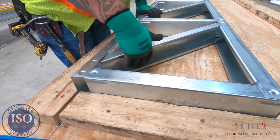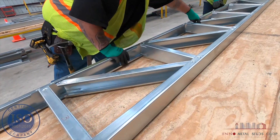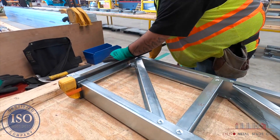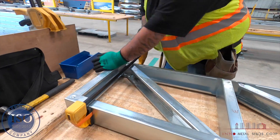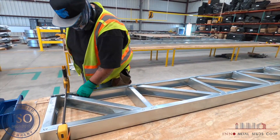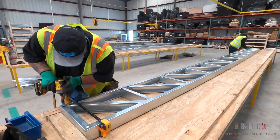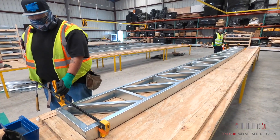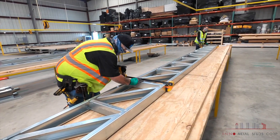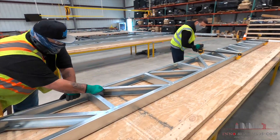Next, you're going to want to put all of your diagonals hooked inside so you don't get caught up and make it more difficult. Coming back to this corner, if you're working this side of the table, it is very important that you put your screw in first so that it doesn't move on you. Once that is in, you can continue putting the truss together using your trigger. You don't want to be fighting with the truss all day.